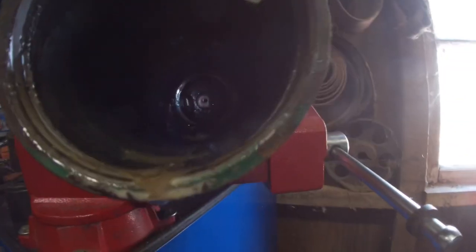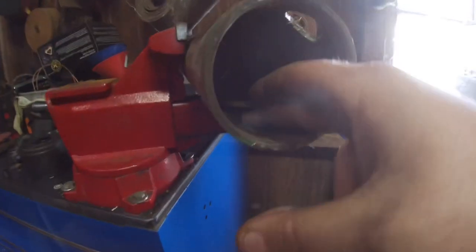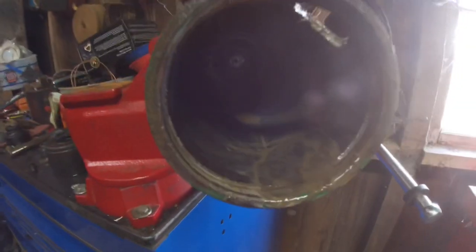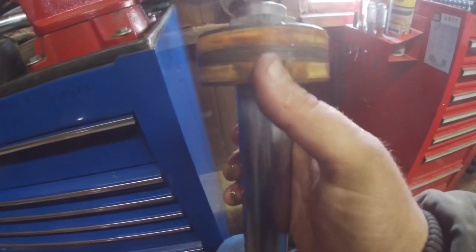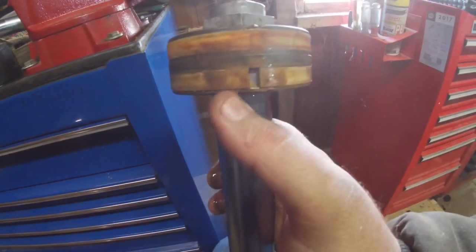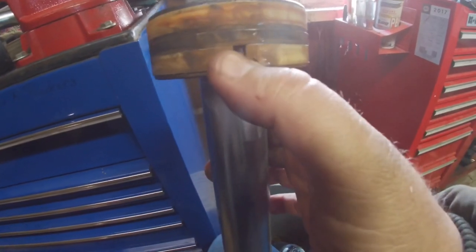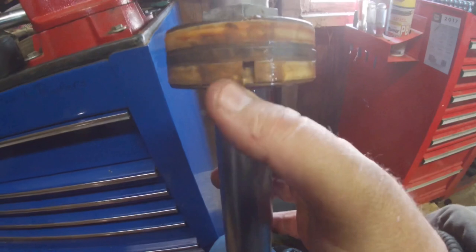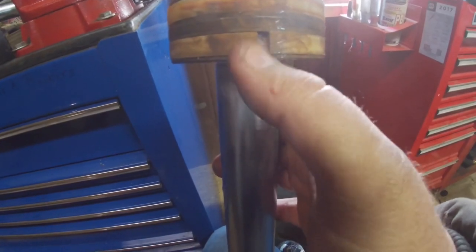On this end you can see we just have an empty barrel here. It felt like there was a little bit of a ridge in it when I was pulling it out — this cylinder put up more of a fight than the other one. If you check out this end, here's your piston. You look at it and you think there's a seal split, but actually it's got three things on it. The outside two are wear rings, which are designed to basically hold everything square in the bore. So it's not a problem that they've got that split in them — that's the way the new ones are too.